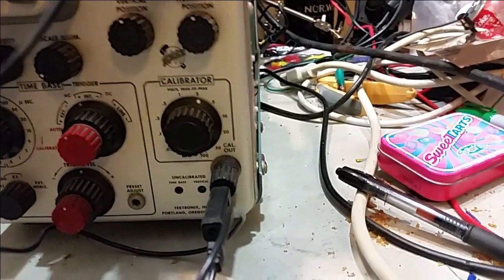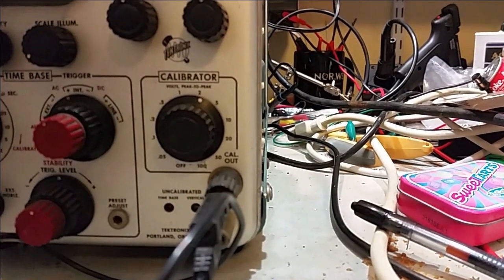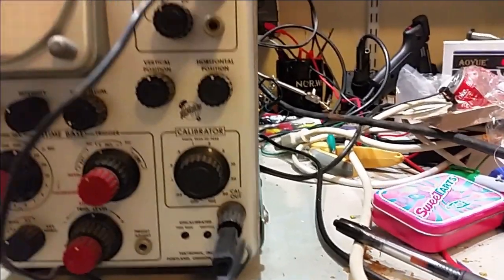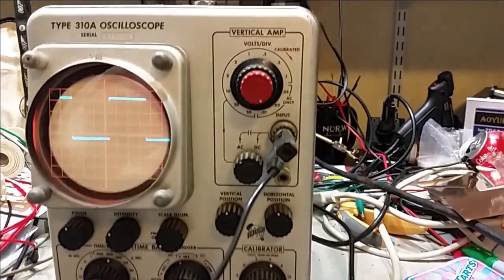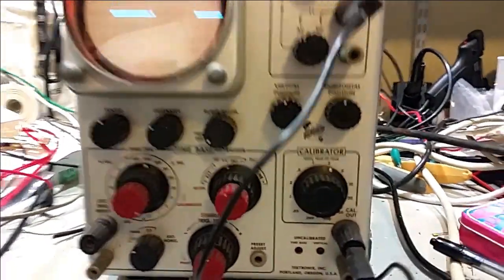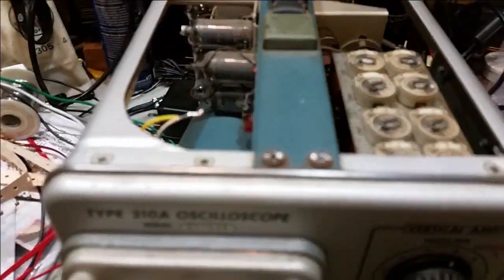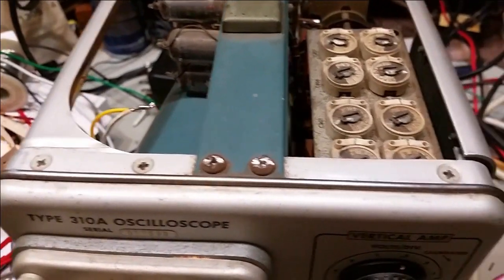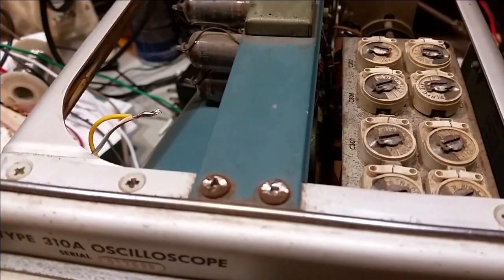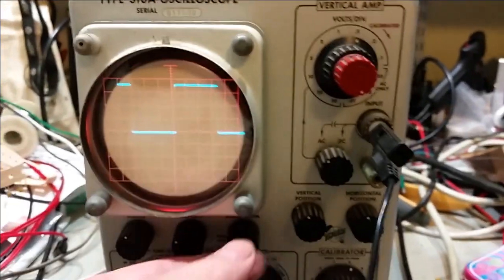Things are going. Nothing's calibrated at this point. The calibrator is kind of interesting because it goes all the way to 100 volts at basically 1 kilohertz — 100 volts is a pretty healthy output for a calibrator. The input voltage goes up to 50 volts per division. It's actually coming along pretty well from the electrical restoration. I did have to pull the CRT out and clean the socket, and I did some other cleaning while I was at it. You can see the pair of leads there — that's for the illumination of the reticle.